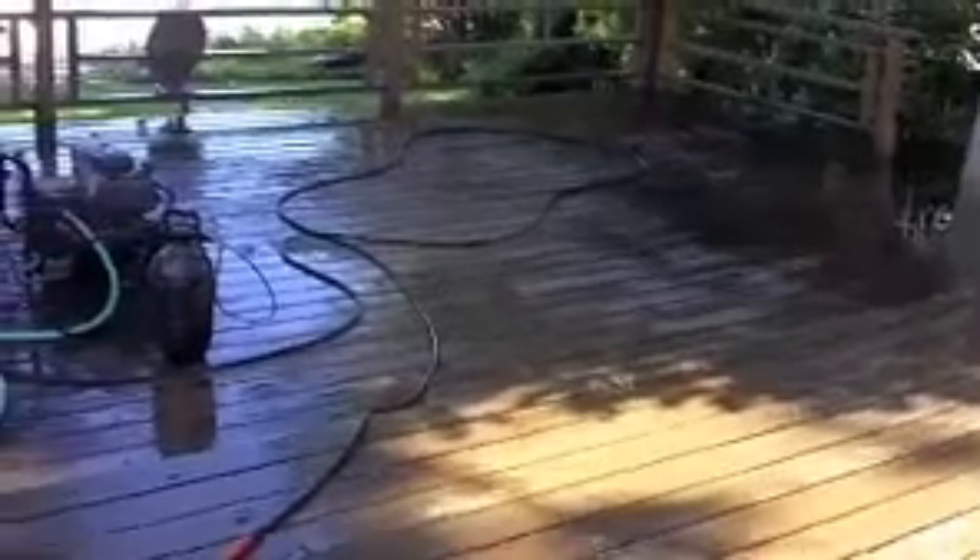The deck and the dock — a lot of people wonder what do you put on your deck. The biggest thing is do not paint it. Solid bodies are not made for decks, so a semi-transparent oil is what you want. I shot this little video to show the proper way.